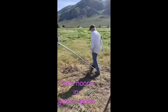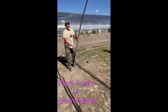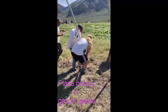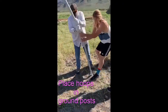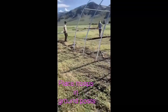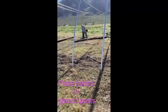Once your posts are in the ground and you have the sleeve in place, you can drop the hoops in — just make sure you hear them click. When you put your hoops in place, make sure they are in direct contact with the ground posts so they're not held up by the sleeves. Mounting the hoops is pretty simple and you could do it with one person, but it goes a lot quicker with two people.